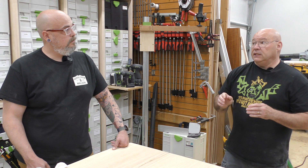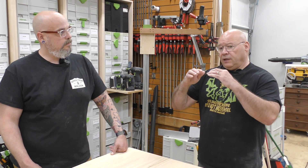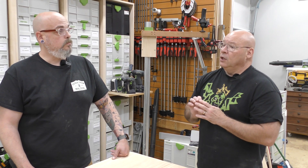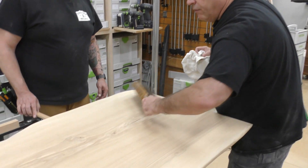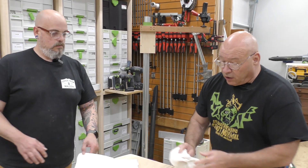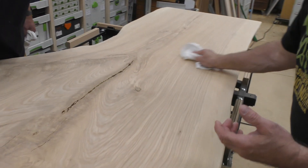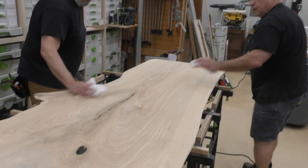Big D, we just finished with 60 grit. Here's a step a lot of people forget: 60 grit breaks down as you sand and creates new sharp edges on the grit, but sometimes it comes off the side. Before we move on to 80 grit, we're going to do a quick sweep and wipe of the board to remove any particles of 60 grit left on there. That way we don't get unnecessary swirl marks from a lower grit.